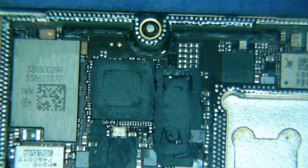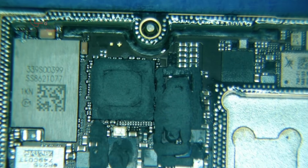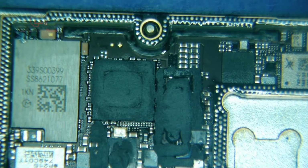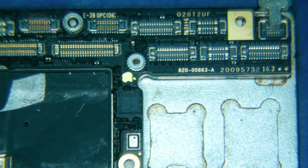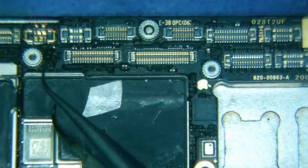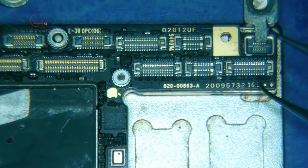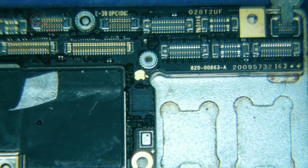Again, you can buy a special flux made just for this purpose, but I've survived without it for this long, and like I said, I'm just going to apply it to the surface, thin it out, remove any excess, and make sure that we have a nice thin layer all the way around the perimeter. Now I don't know if you can see that, but the board does not really sit flat. It's kind of sticking up at this end. If I put it flush on the bottom, over here it's actually lifting up. So if this happens on this particular model, if it doesn't even out once we heat it up, we will clamp it down, and that's one of the reasons I do like to leave the spacers on whenever possible.